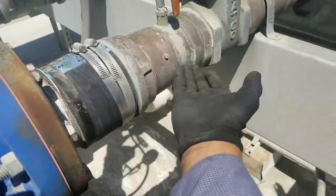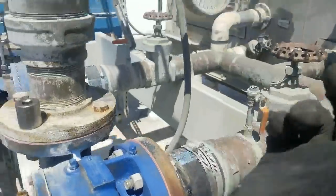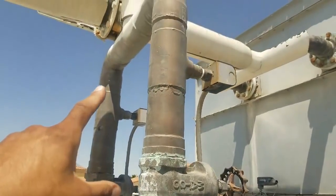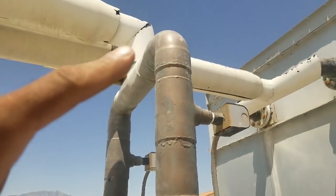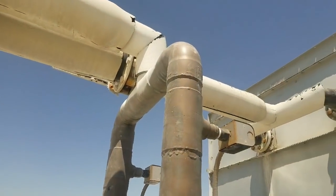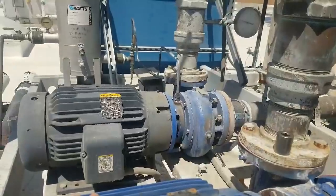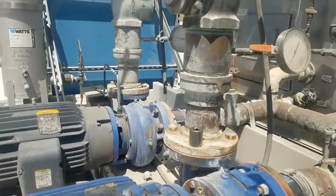There's still water sitting down in here, so once we pull this out water will come spilling out. This line here is also connected to this line, so if you look on top they're together — they join in with that top line right up here, all the way up here to the butterfly valve. That's a common line right there. We could still — the tower will still operate with just that one pump right there. So that's what it's doing.